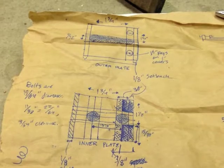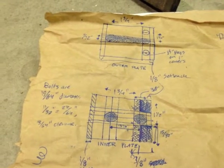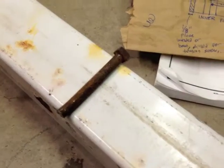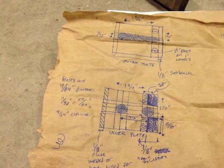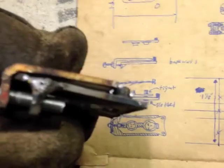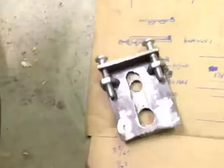I was having a little trouble figuring out the tensioner, so I went and marked it out to within a 64th of an inch, and I think I've got a pretty good design. Now I'm going to take my super precise plans, and take an angle grinder, some rusty scrap metal, and some random fasteners, and try to make something vaguely resembling that — and then probably wallow out the holes with a cordless screwdriver until the damn thing fits. Well, it bears a passing resemblance to the drawing. I did have to do a fair bit of file work on one of the holes because I managed to get it way off somehow, but it should work.